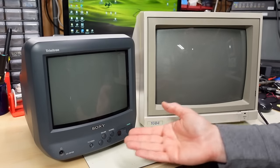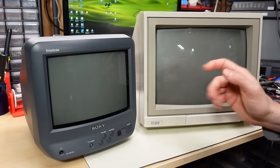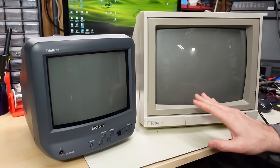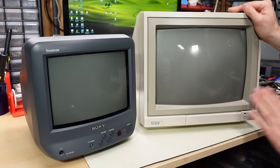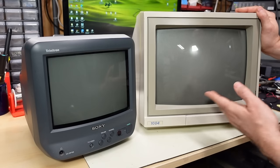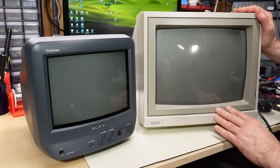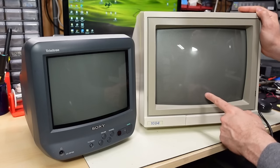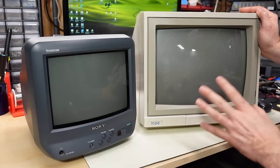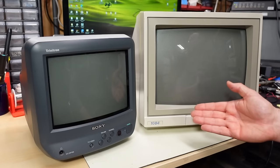Regular viewers know I'm a huge fan of CRTs, especially with old retro computers or video sources like VCRs — things designed to be used with CRTs that just don't look as good on high-resolution modern displays. This is my trusty Commodore 1084 monitor, made by Philips and one of the most versatile 15 kHz displays around. It's a 13-inch CRT with a built-in speaker. It's pretty reliable, although the flybacks seem to go bad on these a lot. If I need a 13-inch CRT with RGB, I'll get this out. But what I don't have is a smaller monitor with RGB — that's where the 9-inch set comes in.